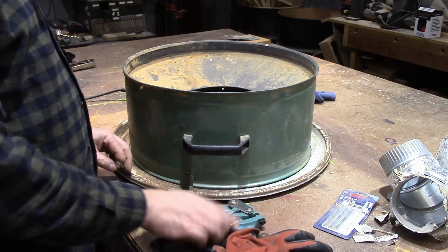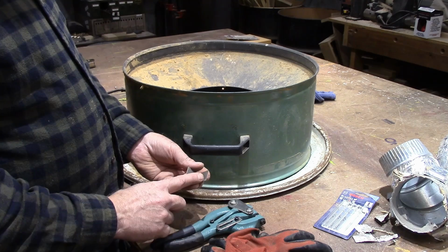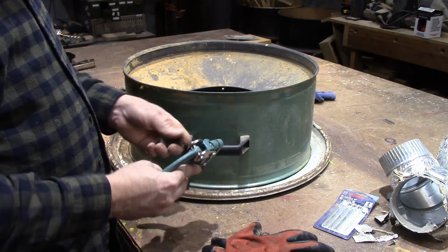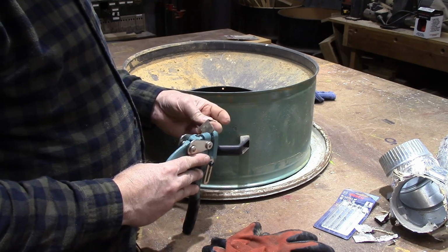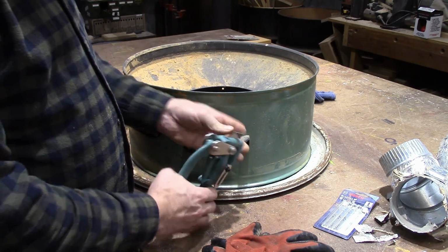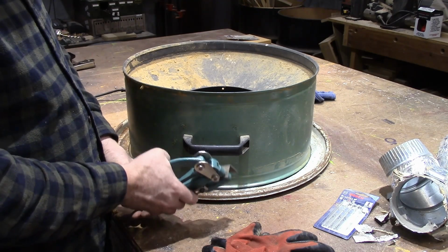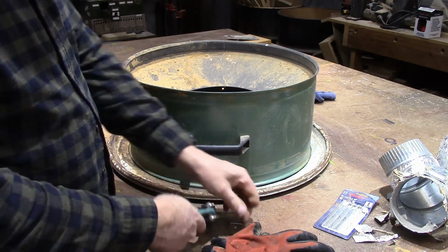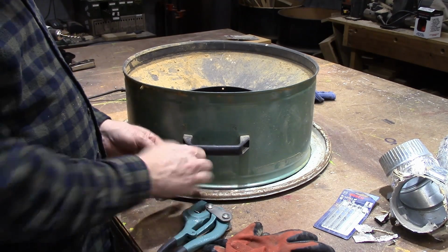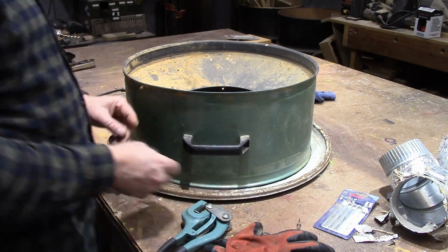And so in order to do that, I need to punch some holes. I've got this hole punch right here, and I'll put a link to one of these in the description in case you're interested in buying it. I've had people ask about it before. And then you can just punch holes, because drilling holes in sheet metal like this is kind of dangerous because it'll grab and spin around and cut your fingers. But these punches work really well like that. Now you could also use screws, or you could drill holes and use bolts. I'm going to actually rivet these in there.